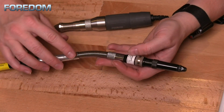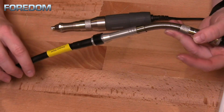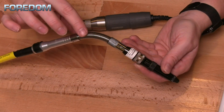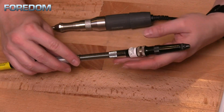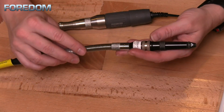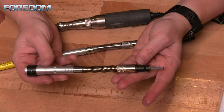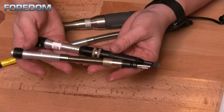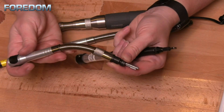When you use the duplex spring option it is nice because it pulls some of the pressure of the flex shaft off of you. However, if you operate this at more than a 30-degree bend you are at risk of breaking it. On the hammer handpiece that comes with the duplex spring, if that spring breaks it can be quite costly to repair. However, you can buy an adapter and use that with just a regular hammer handpiece, which is a far less expensive option, especially if you tend to work tighter than that 30-degree bend.